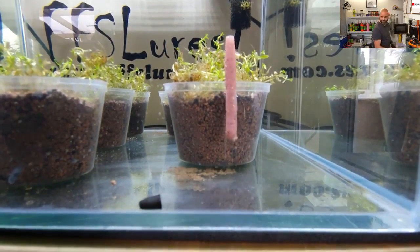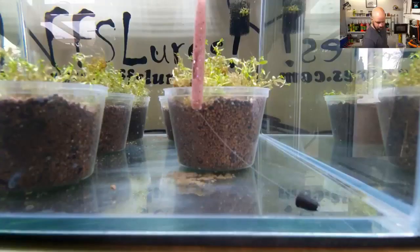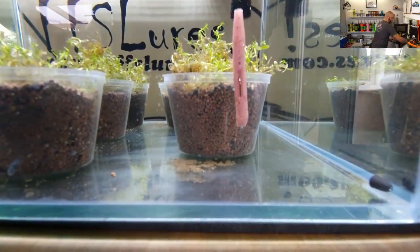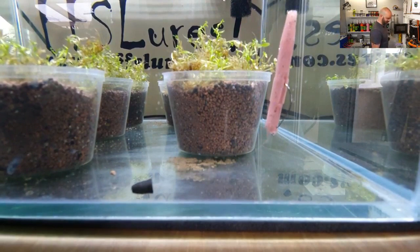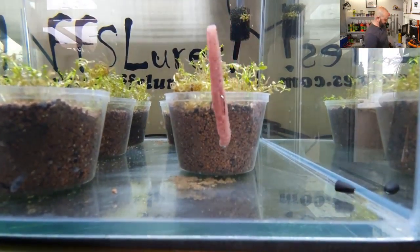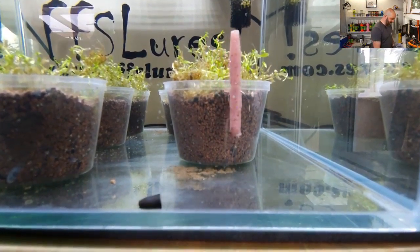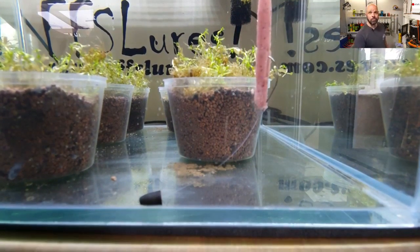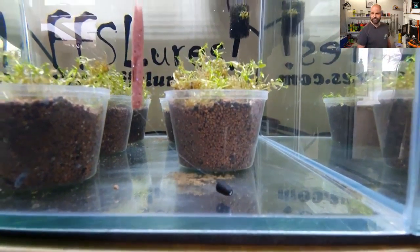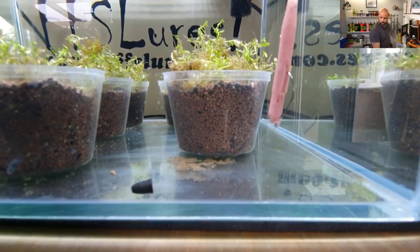The colour on this, let's go back to it. The colour on that is just a mishmash of waste, so it really is nothing special. I can't replicate it, it's a one-off. It's actually what I do to clean out the mould. I grab a handful of the waste material, heat it up, and shoot it through. It takes out all the aluminium filings and what have you.